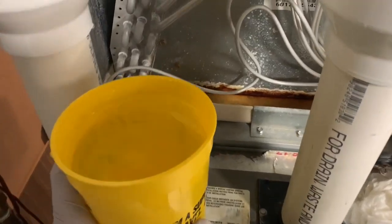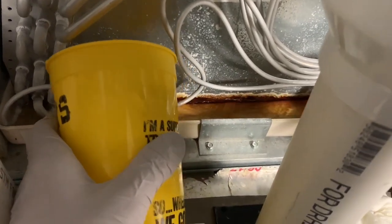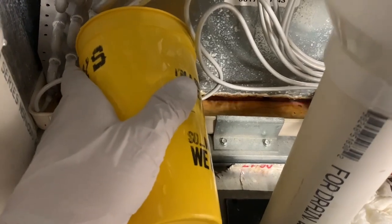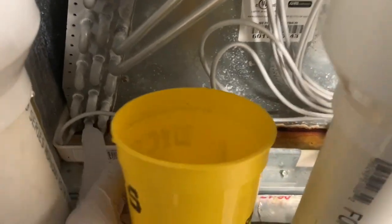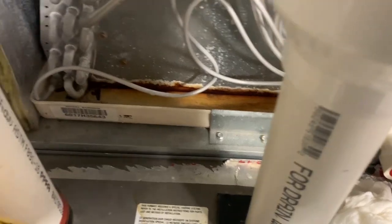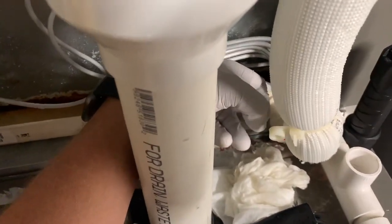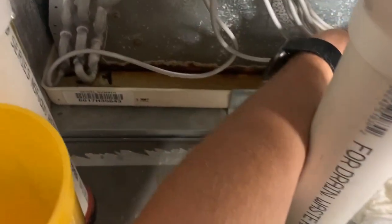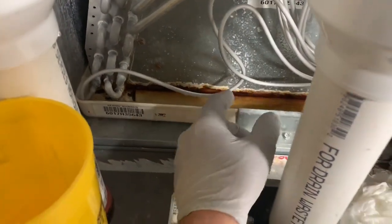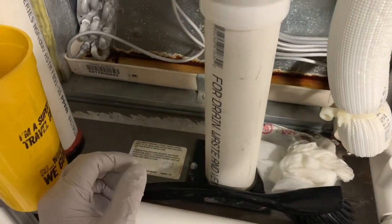Last step — I've got more hydrogen peroxide and water solution and I'm going to pour it right into the tray. Put a bunch in at once; you want the water level to rise up in that tray. Don't be afraid to put a couple cups in there. As the level rises it also covers anything submerged in the corners with hydrogen peroxide and water. You can stick your finger down over the drain hole to plug it up so it works better — but there is a lip on the inside and you don't want that water draining down into the motor, so be careful.